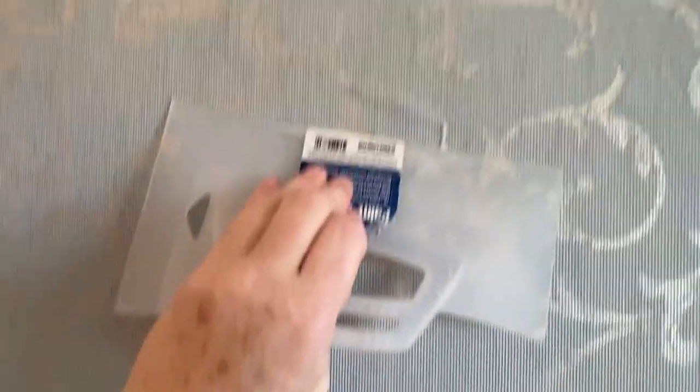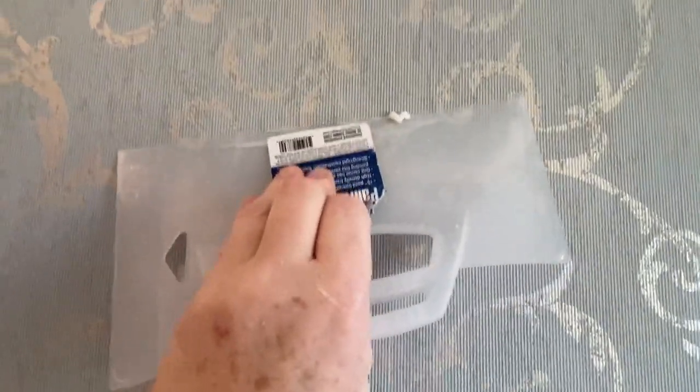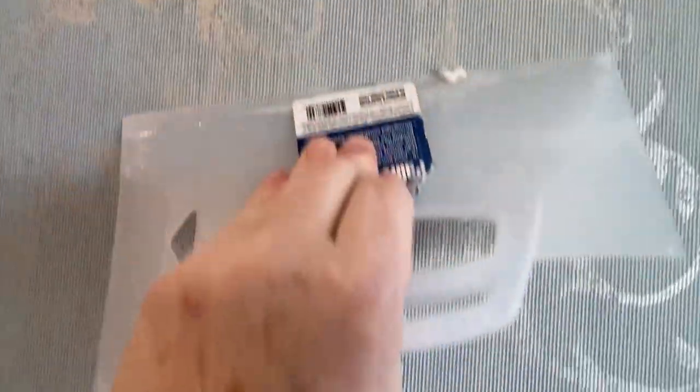I think this is what freaks people out with wallpaper. They don't want to touch it. You hear the air? You see that paste? It's good. We move it into those areas where it makes that noise. And we fill the points of detachment. That noise is detachment. Not like spiritual detachment. No. This is physical detachment. Okay, looking good. And then we just wipe it down and proceed.